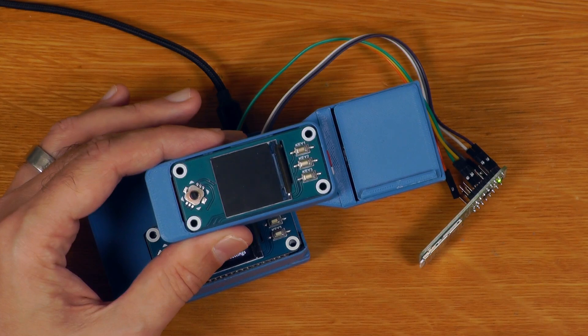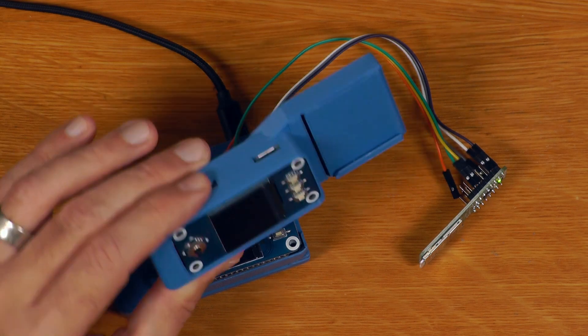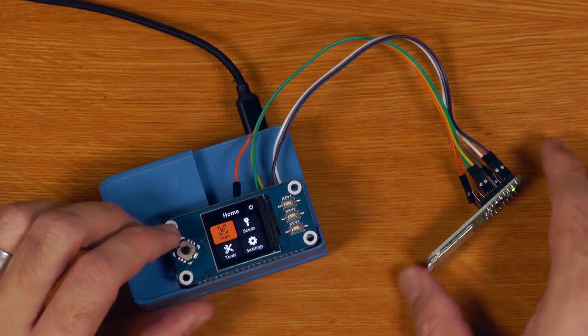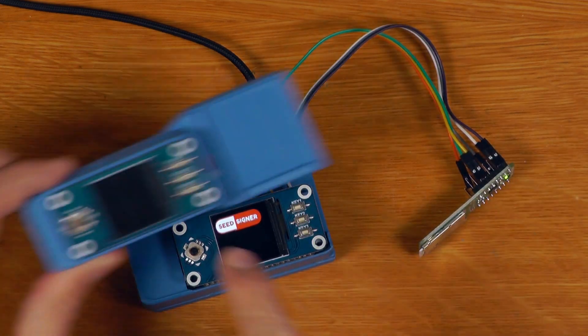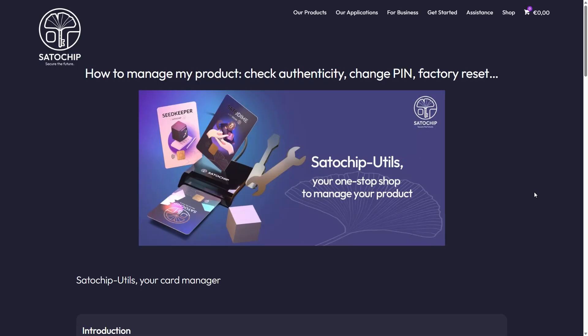This is also a good spot to give a quick sneak peek on something I'm working on for SeedSigner. One of the big shortcomings in my previous approach is the quality of these PN532 boards — lots of clones struggle to work. What I've got here is a full smart card reader that wires into the GPIO pins on the Raspberry Pi, giving you a low-cost, reliable smart card connection without needing USB ports. The end goal is to reformat this into a HAT that fits between the screen and the Raspberry Pi board. Keep an eye on the SeedSigner Telegram group if you'd like to help test these boards.